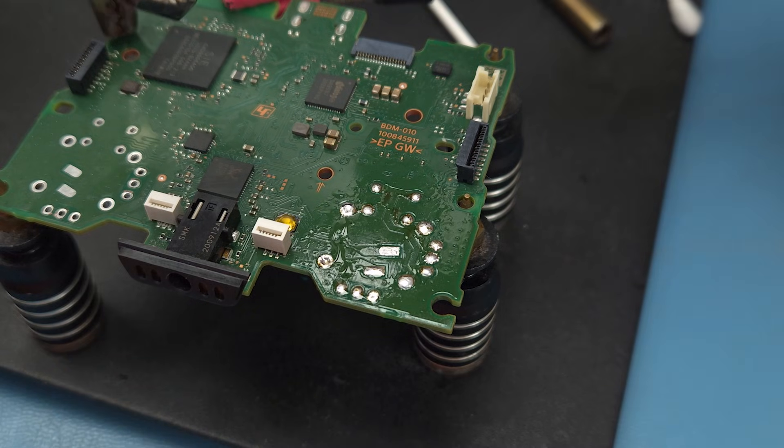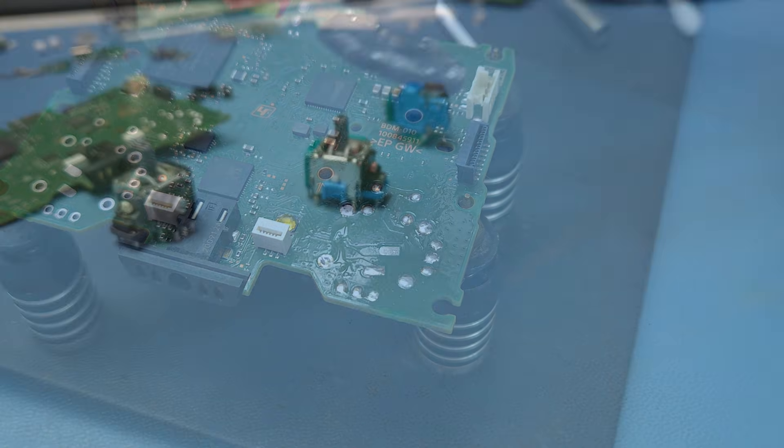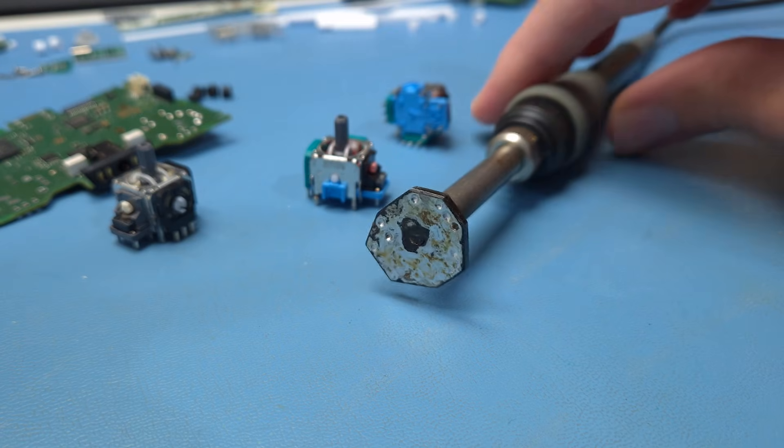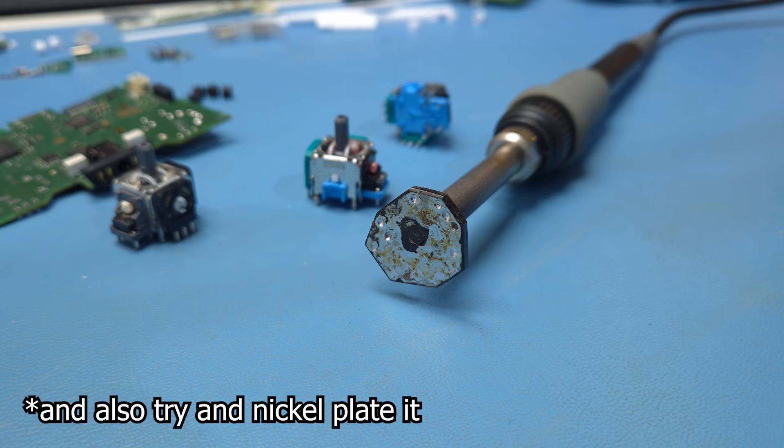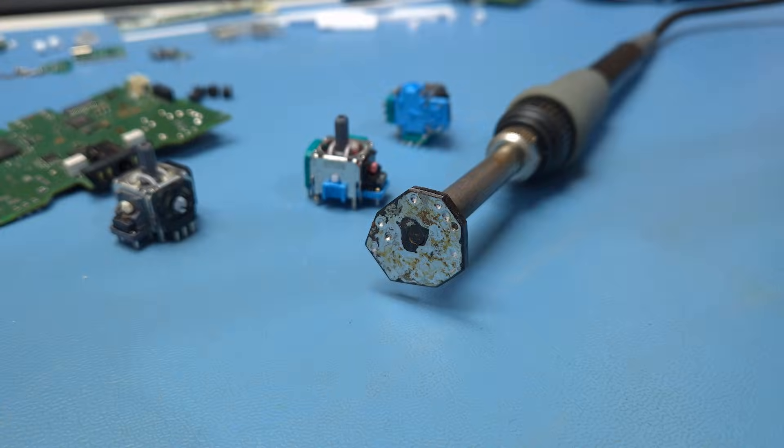So the verdict is, it works, but I don't think this 2mm piece of copper is really thick enough. These multi-layer boards suck all the heat out of it, and it takes too long to get back up to temperature. If I was making a version 2, I'd use a 5mm slab of copper. Anyway, it works OK. Link's in the description if you want to buy one of those other ones.